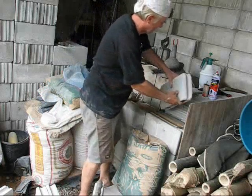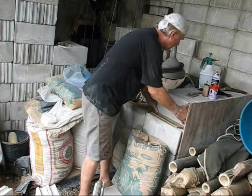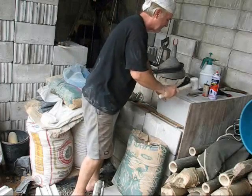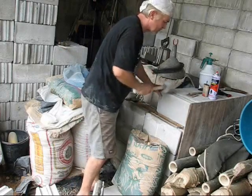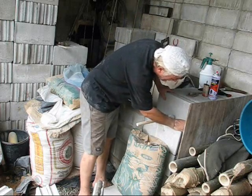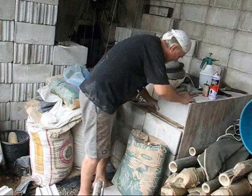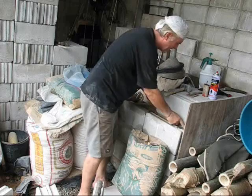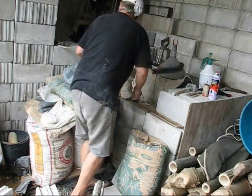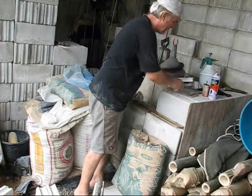I mean, I think it's possible to put a whole bunch of cement down there and do more. But I like the blocks to be really just kind of smashed right together. And if you do the cement ahead, then the block that's there sucks the moisture out of it, and you end up with more of a space there. It's not the way I do it. Also, not a bad idea to have one of these things around.